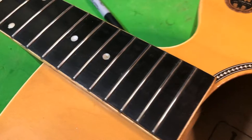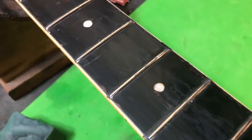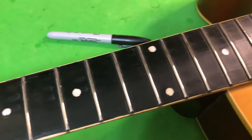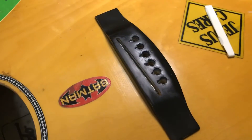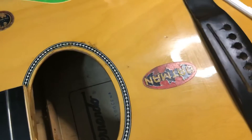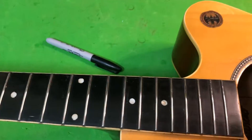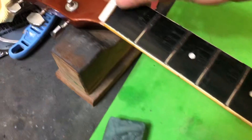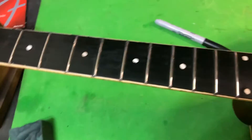There they are - look a little nicer, yeah? Smooth. You can see some marks in there but they're fairly smooth. I didn't take them all the way down simply because if I do, it's gonna need new frets. But definitely much better, and I'm sure they're gonna bend much nicer. Cleaned up the bridge, got a bone saddle already made - you gotta take a little off the bottom to get it to the correct height. And I have one bone nut that I made earlier but it's just a little short, so I had to make one fresh. I better get back at it, it's getting late.